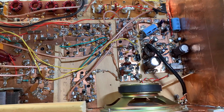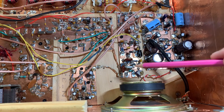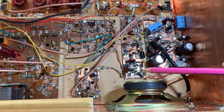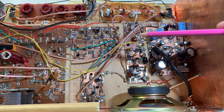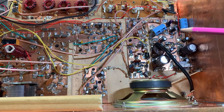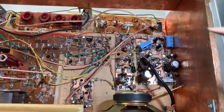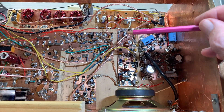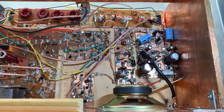For a while I thought that maybe it was just proximity to this big speaker that I have here — maybe there was a coupling going between the output of the audio amplifier and the input here to the carrier oscillator BFO. I had an SBL-1 mixer here and it would all just go around like that. I was thinking it must be some sort of combination. To isolate things a little bit, I broke the connection from the TIA amplifier into the mixer, and I also broke the connection from the mixer into the audio amplifier.